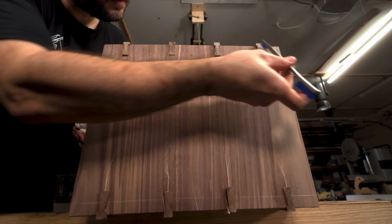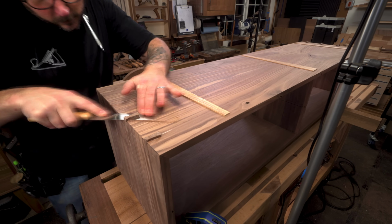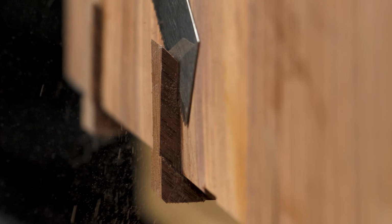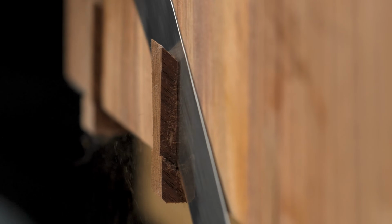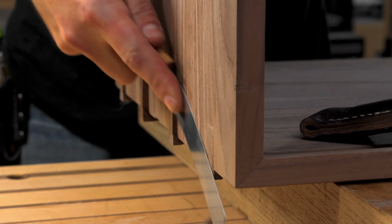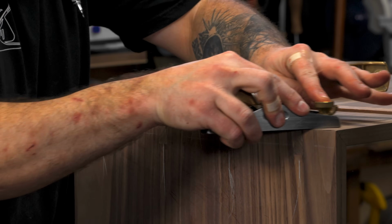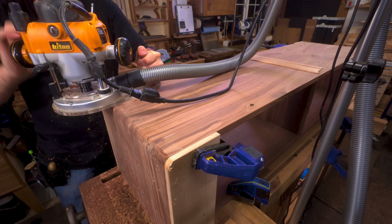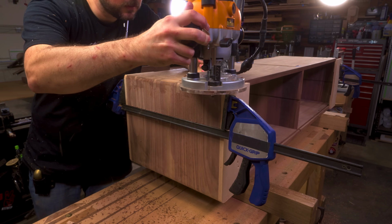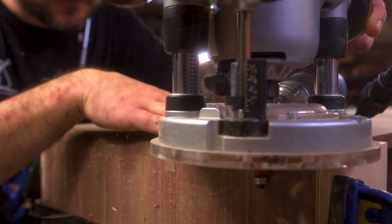Once the dovetail keys are dry, they're flush cut, and I've opted to soften the overall feel and look of this piece with a hefty roundover using a big ass roundover bit. The front and back edges of the box are supported with a sandwich of plywood. This will keep my big ass bit from blowing out the precious grain at the front and the back edge.